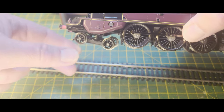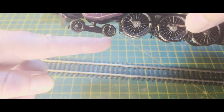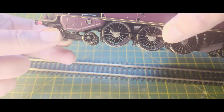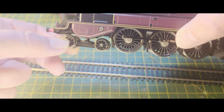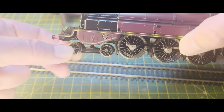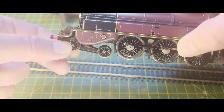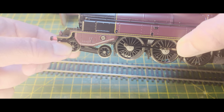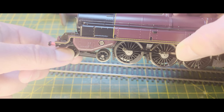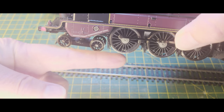If you look at the bogie — back in the day they used to attach these bogies so they had what they used to drop right down, where my fingers are. They had loads of movement to take up the slightest little misalignment in track or anything. But this thing, as you can see, that is now under gravity — that's as far as it goes down. And it's absolutely level at track level. So any slight lifting up or down, the back wheel or front wheel goes a bit above the track and it's no longer on the track. That has to be able to hang below the main driving wheels, so those wheels should be at least right there — not there.